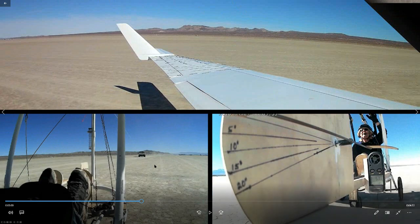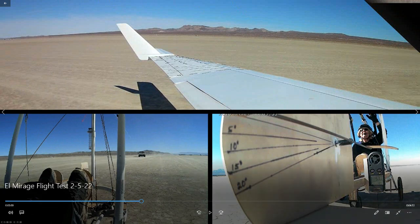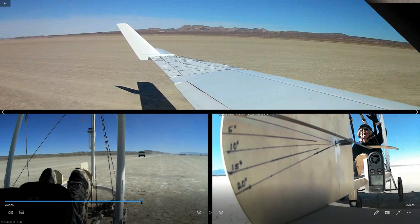And unfortunately, I couldn't have been more wrong. Bob was right. I was wrong. It was a problem, and we eventually had to resort to a Y bridle. And eventually I'll get some type of mount for the towing rig set up somewhere on the nose here so that we can do single point towing through the CG. But towing through the CG was critical, just like a regular hang glider. I thought the Elevons would allow me to get around that, but not really.